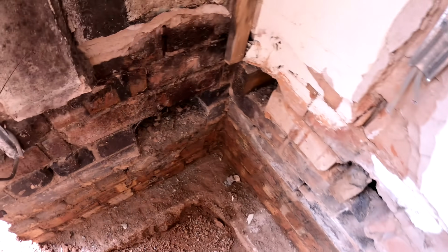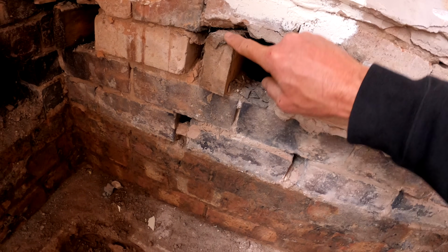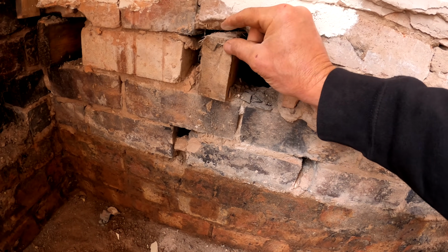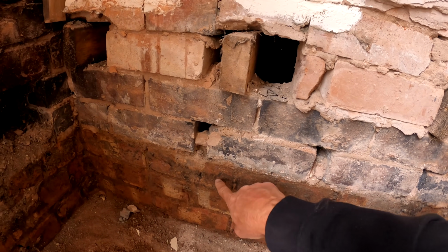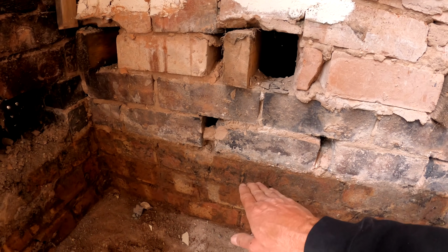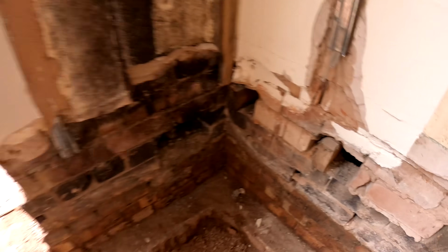Now the other thing we've got to take into consideration is that they're the floor joists of the other floor, the other side. So you can imagine we've got 20mm on top of those, haven't we? So what we would do is measure the 20mm, then measure down what we require to the underneath of the beam, which will tell us where we've got to make sure we do the relevant brickwork and cut the slot too, so we can make sure the block and beam sits in, and we'll wrap it in damp and then it can sit on there quite nicely. So let's have a quick look.